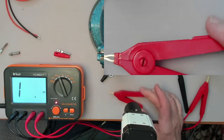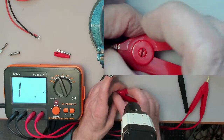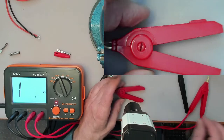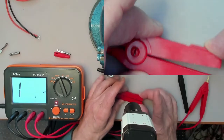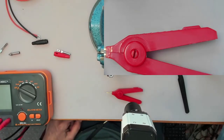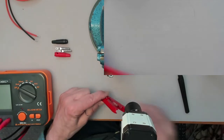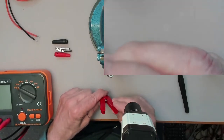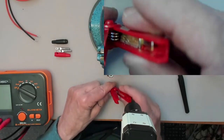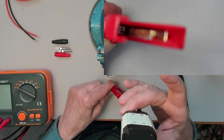However, because they have two different connections to these tips, we have to connect them together, because we're just going to have one lead coming out of them, not two. Now, in order to connect wires to this thing, they have to be soldered, and inside there is a spring. See if I can focus that a little bit better.